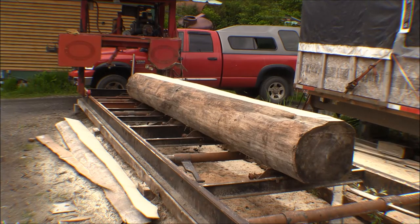I worked between rain showers yesterday and got the mill all back together. Got the casters back on it and working, and then put the cam followers on underneath it. And then hooked the drive chain up, and made a pass on that log. Cleaned up that one face of it, and then I turned it 90 degrees and made another face on that side. And then I got a slab off of it, of course, and I got a good 1-inch flitch off of it.